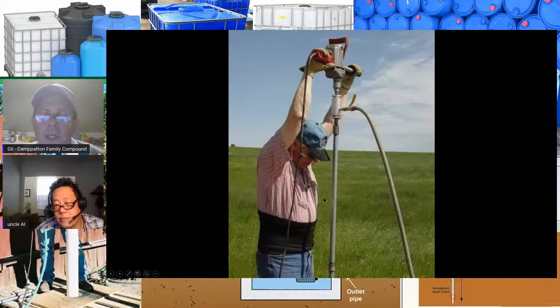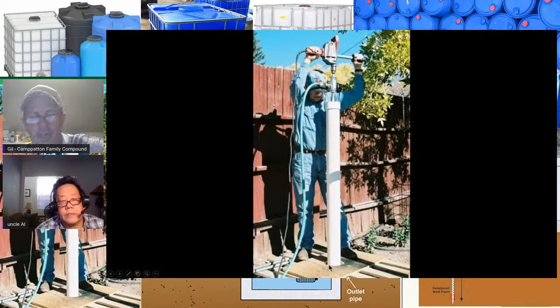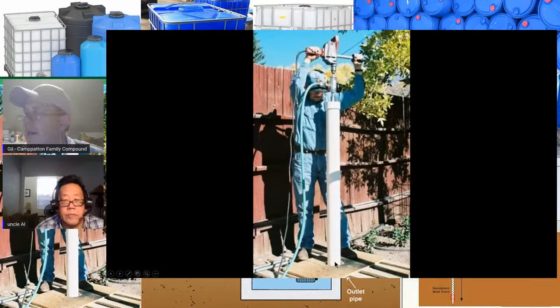Here's the small version — my brother had a landscaping company when he got out of high school and he used a little device called an Aquamole for drilling underneath driveways horizontally to run PVC pipe or sprinkler lines. Using something like a Milwaukee drill, you can only go down so far before you need more horsepower. Here's one done with a casing: they run the casing down, use the auger and jetting below it, the mud and water get cleaned out from underneath, the pipe drops a little farther, and they keep lowering the PVC casing while pumping the material out by forcing more water in.